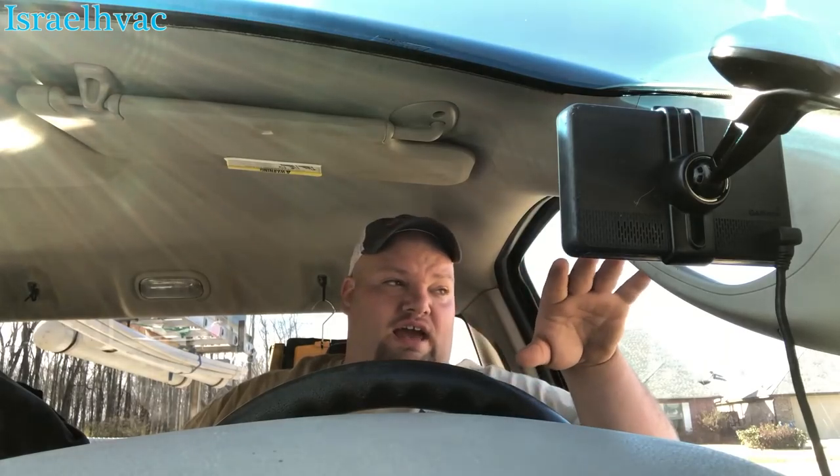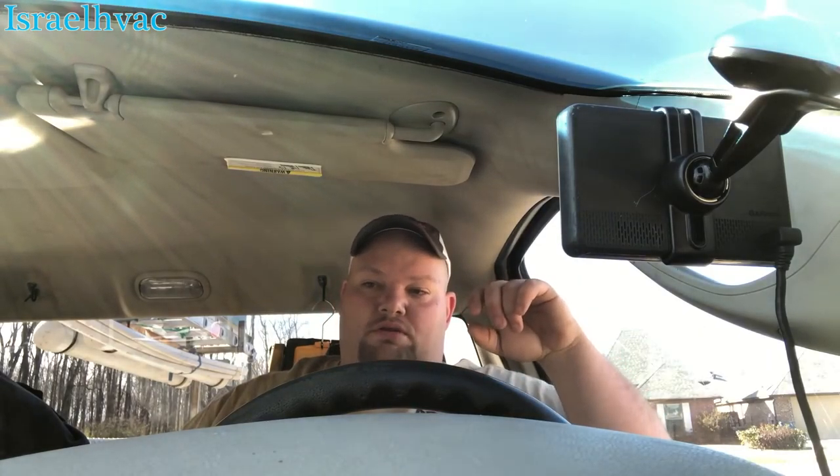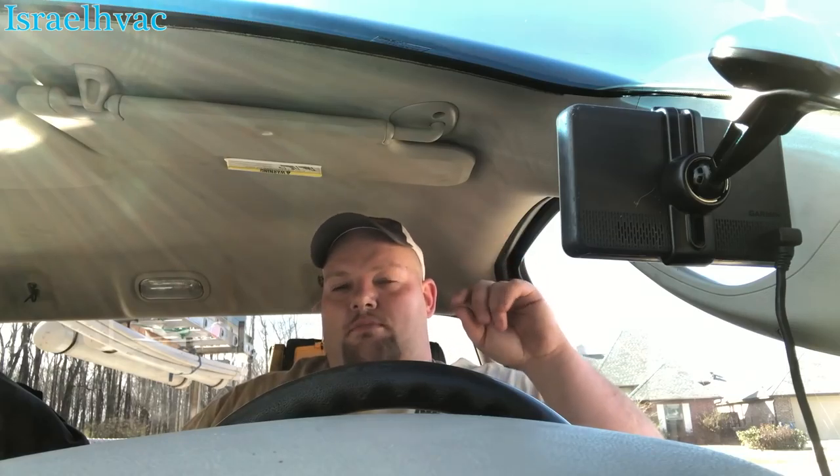Guys, you've got to keep in mind, this is a different ball game from what I'm used to. We have three change-out crews that do a change-out every day, and when we're busy during the summer, sometimes they'll do two a day. We do nothing but high-end equipment. I've been here two weeks and I've seen one 14 SEER leave the shop. With a change-out being done every day, that's not a lot of 14 SEER — everything is inverter or at least 16 SEER.